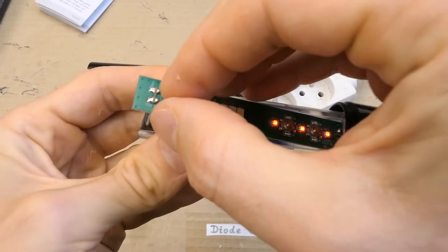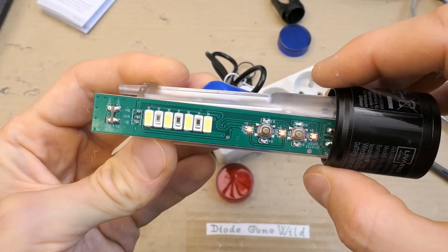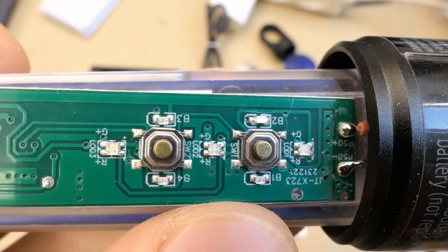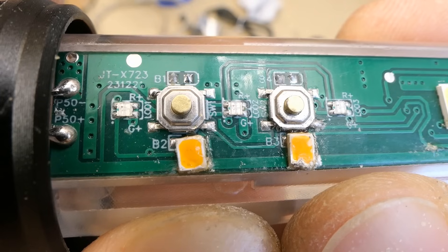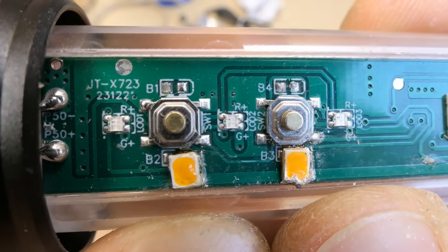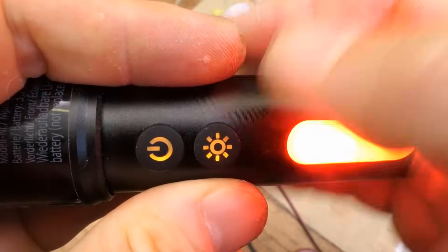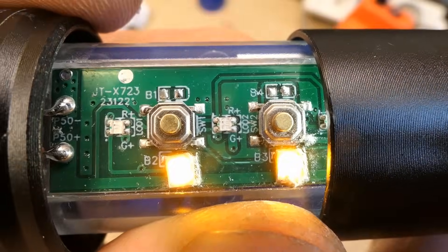The charging cable goes in here and that's the red LEDs indicating charging; the green ones are in the same packages. These blue LEDs annoy me. What if I put yellow LEDs here? The blue LEDs are removed — I didn't like them of course. I horribly botched some yellow LEDs into it. One pair of button LEDs is enough I think. And now the buttons are yellow — much nicer. Nice botch.